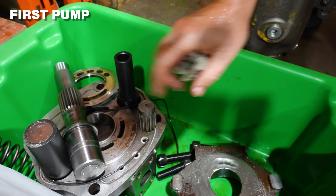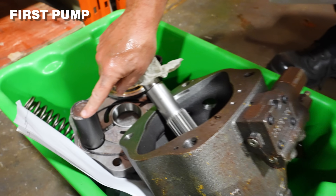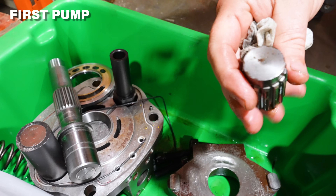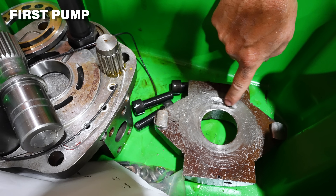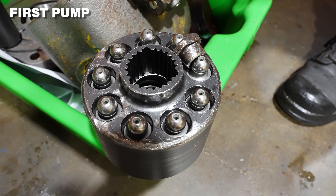The first unit that came in looked like it exploded inside. The port plate was grooved pretty good. Several pistons were all beat badly, and the shaft is now two-piece. That's where the pistons — you can see where once all the heads have been snapped off, the round part came in here and just tore it up. A lot more pull-off on the pistons.